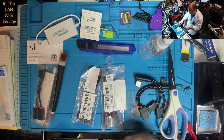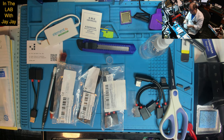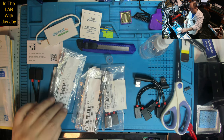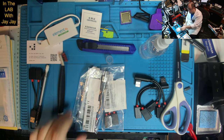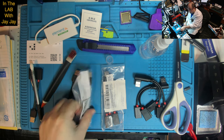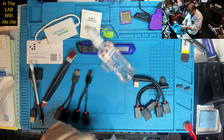Now I'm going to install one of them over there on my lights. You can see the lights when I start my videos. I've got my Xbox light and I've got my on-air light, and those things are powered from some USB cables. And I had to install a resistor, a potentiometer, in fact, in series with it so that I could turn the power down because it was too bright, and when it's too bright it's just a big blur on the camera.